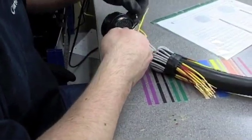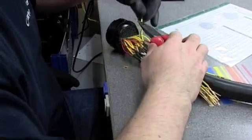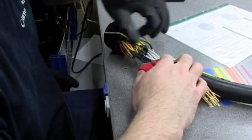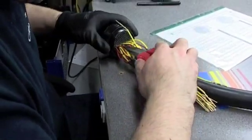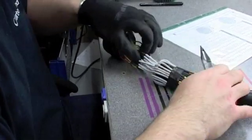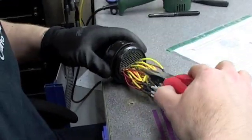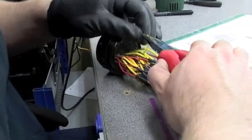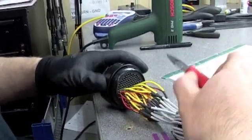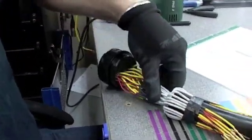On a 150-pin, the higher up the channels you get, the tighter it starts getting. You can sort of feed the wires through as if you were sewing — that stops it getting so tight. What you don't want to do is poke them all in, get them really tight, and then by the time you get to the end, snap the wires where they were too tight to start with.